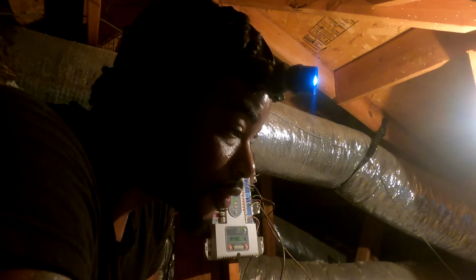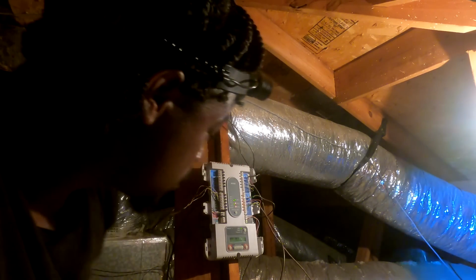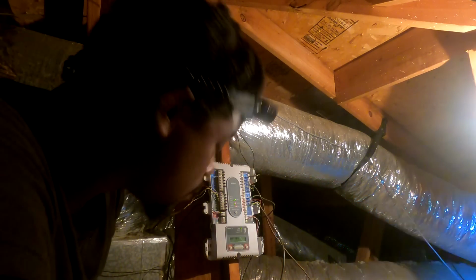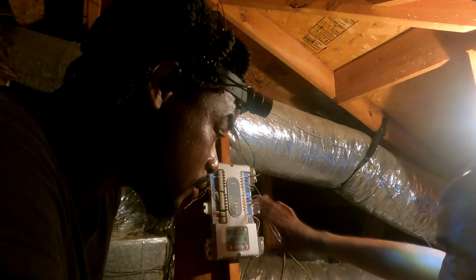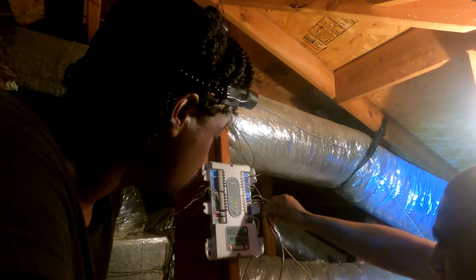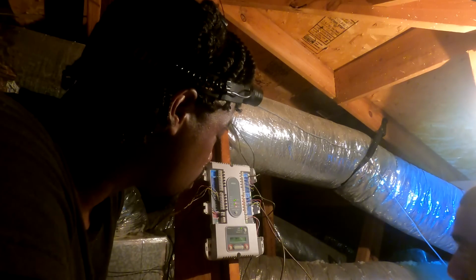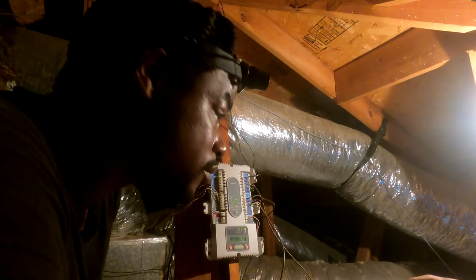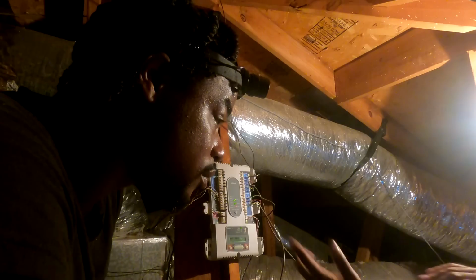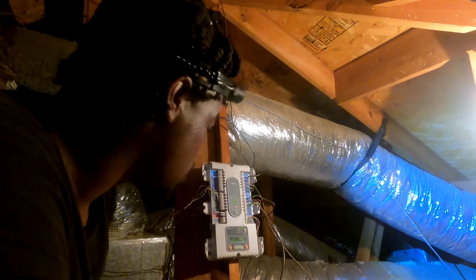All right, she's gonna turn it on. She'll see that because she said she had it off. So whenever you see a zone system like this, 9 times out of 10 they got more than one thermostat. So she just called for it, and that is gonna open up the damper that's over there. So real quick, go see if you can find two of them dampers.